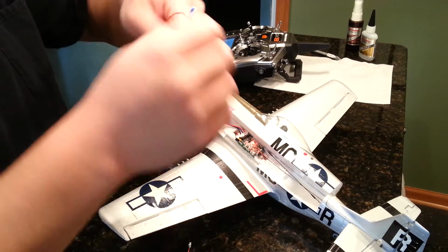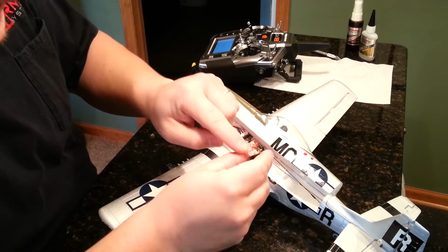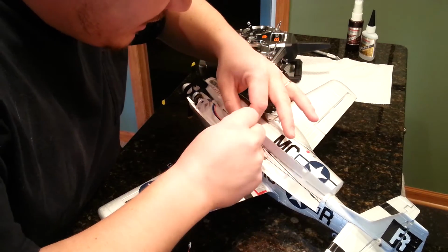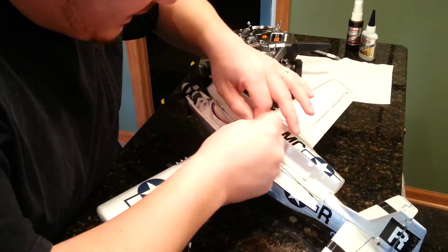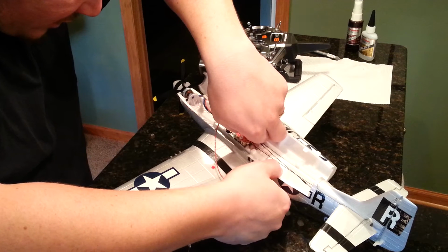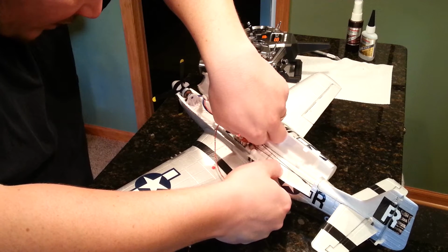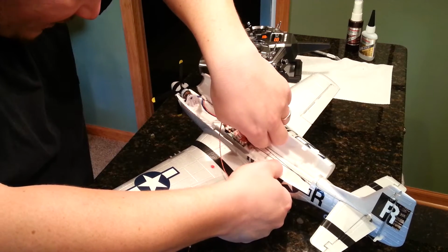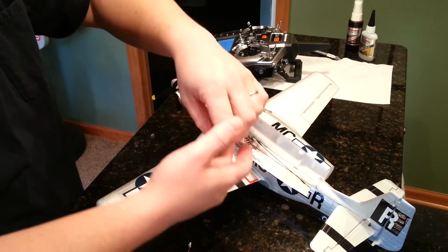And then I'm just going to take this messed up servo, which incidentally I can just replace that gear. I don't have to throw the whole thing away. And these things are keyed in such a way that they only fit in one way. You won't hurt it if you put it in the wrong terminal. It's just not going to work right. So you've got to try both, because this actually has more pins.